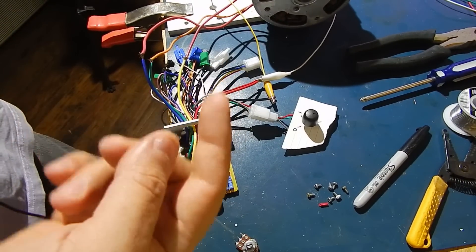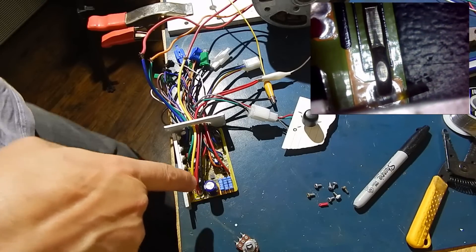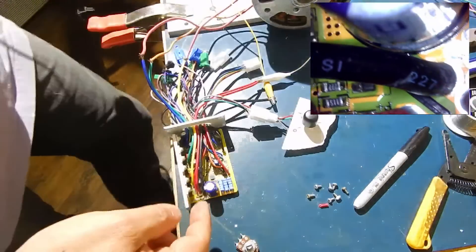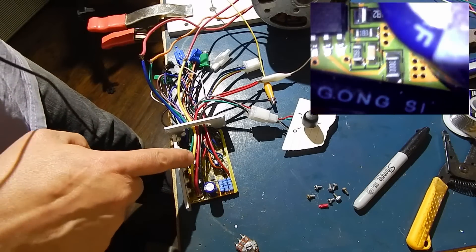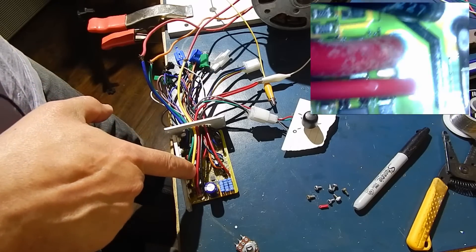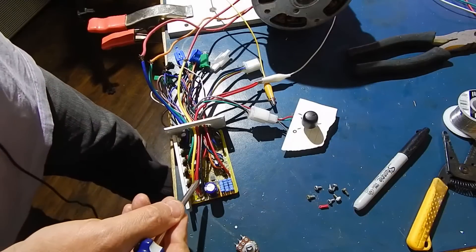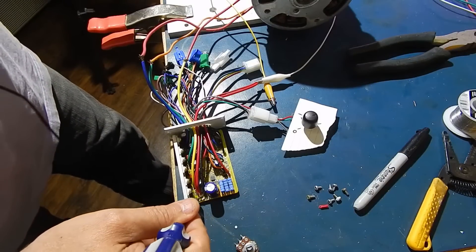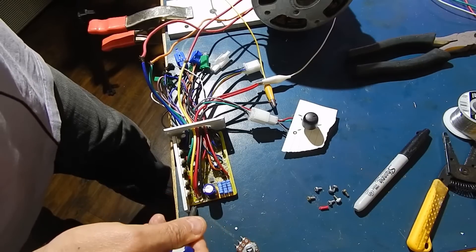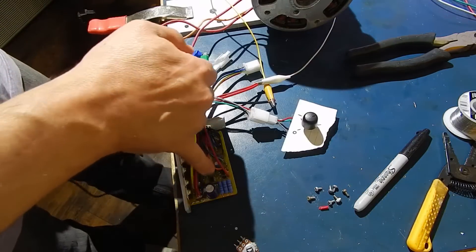In the video I'll leave a picture there showing where I found the trace that goes to the shunt. The trace is on the opposite side of the main power. If you want to look for it, just follow the main power lead — the positive thick one. It'll be the opposite side of the shunt. That's the main power lead going in there, and the trace that measures the voltage across the shunt is on the other side. It could be on the bottom or the top — follow it towards the PIC or whatever IC is running it right there.